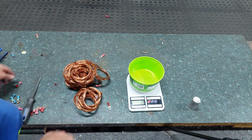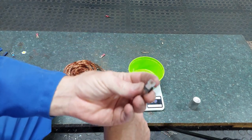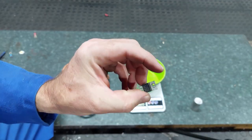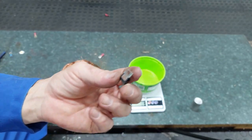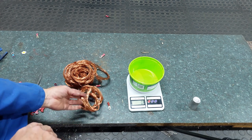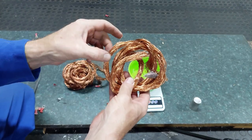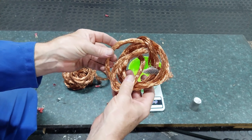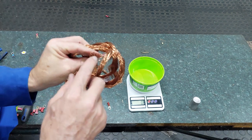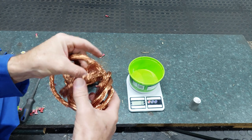So yeah, if you don't have copper cable, if you're into electronics like I used to be, all the components, your transistors, the little back plate on which the silicon is attached is made from copper, so you can use that as a source. All transformers you can use as a source of copper, but just be mindful that if you have microwave transformers, it will look like copper, but almost guaranteed that it will be copper coated aluminium. So it's best just to cut the ends open and look at the tips. If the tip has a silvery color to it, you know it's aluminium.